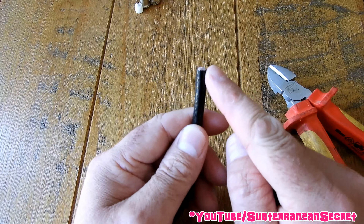Then we get the next piece. What I like to do is put a little bend in the copper core as it helps make a better connection and you should get a slightly better, stronger TV signal. So just put a tiny bend in the copper core, then slide that piece up on, push it on, and slide the last piece on. Then all we have to do is screw it all together, nice and tight. You should see the clamp coming out slightly at the bottom, which should pinch onto the outer part of the plastic cable.